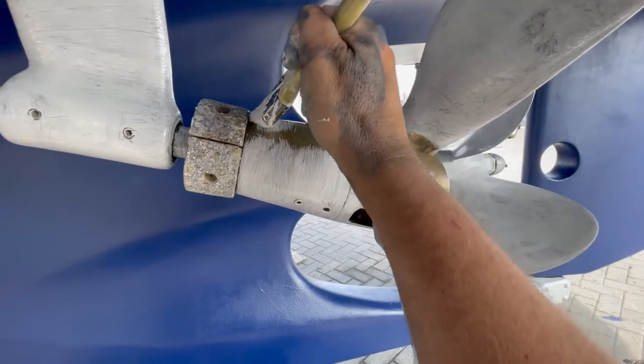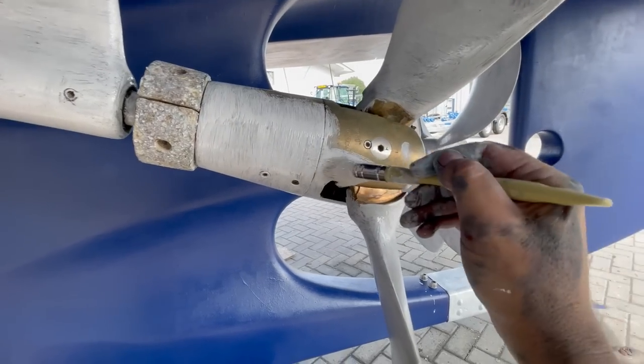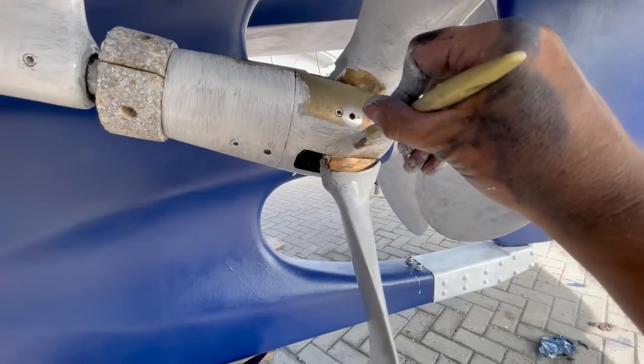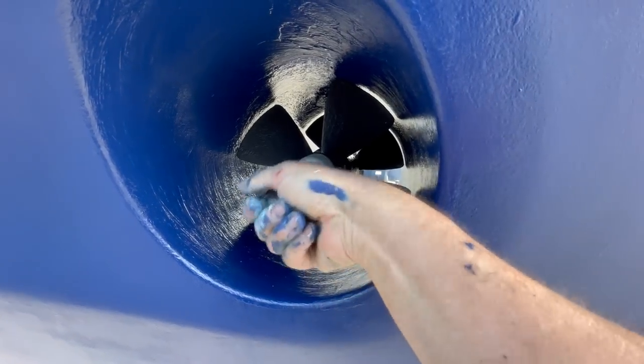This time around I'm using a better quality paint on my exposed stern gear - this is an epoxy primer going on now, very messy. That's the bow thruster - a new aluminium anode, a bit of Loctite.